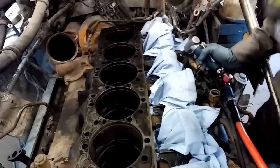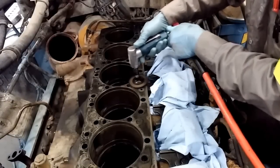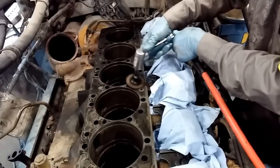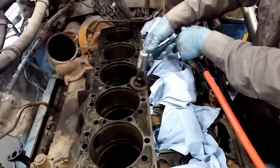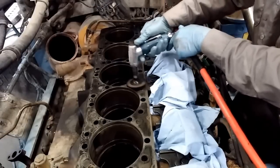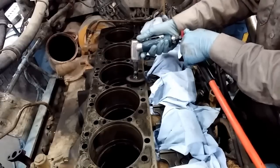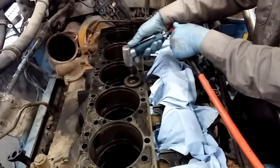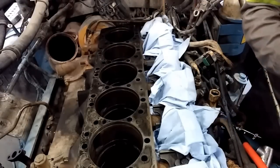I always wear safety glasses, a dust mask, and hearing protection while I do this. A lot of guys don't do the hearing protection or the dust mask, but it's a good idea. I like to use a right-angle die grinder — it's easier on the wrist. I use these Rolok little Brillo pads, and I find they do a really good job cleaning up the surface. Some guys use wire wheels, some guys use the Rolok wheels with fingers that come in green, yellow, or white. I've used those as well, but I just like these brown little Brillo pads. What you're doing here is not really trying to remove material — you're just trying to get the block back to a flat, even surface and get all the material off of it.